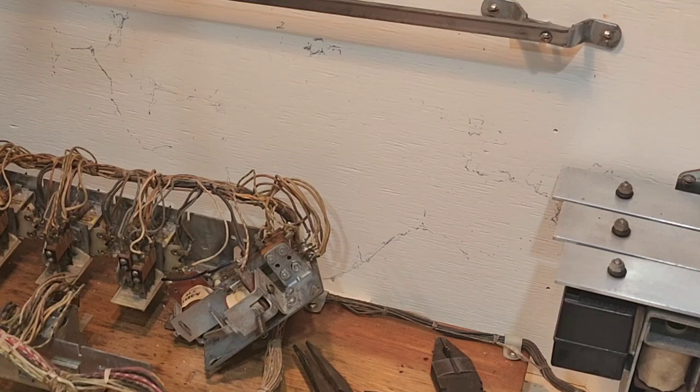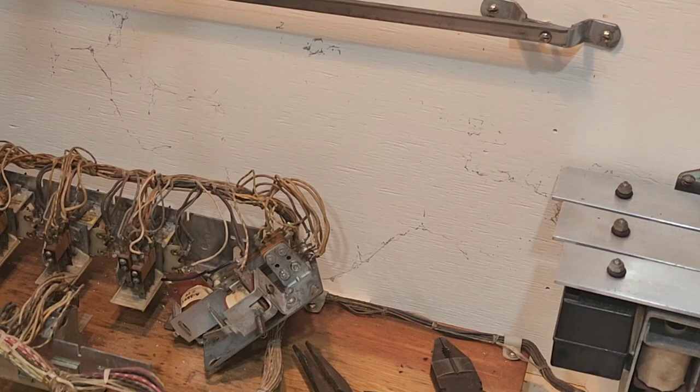Electrically, it operates off a switch on the S relay. When the S relay pulls in and holds on, it spins the score motor, and then a switch on motor TC comes into play. At the same time, that will increment the total play meter and reset the ball count unit. Now both those aforementioned things are occurring quite okay, so it indicates the circuit is working — however, the V relay doesn't pull in.